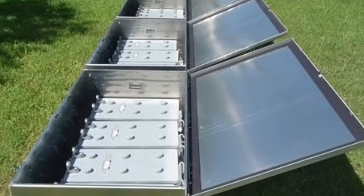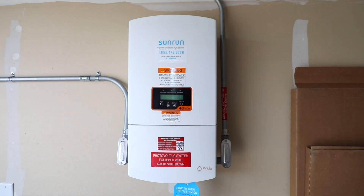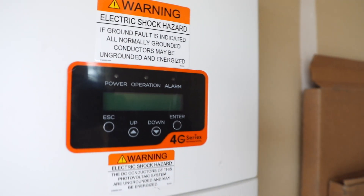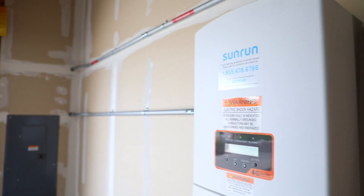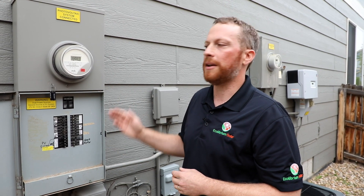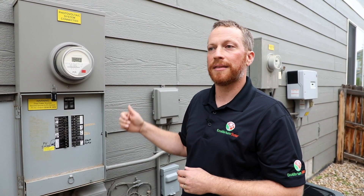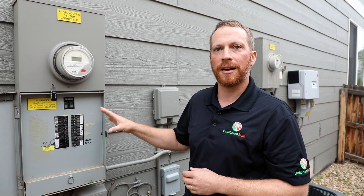You may find a battery bank — it could be a bank of batteries wired together contained in a battery box, or it could be a self-contained unit mounted to the wall that's a purpose-built battery bank. Often the charge controllers are integrated into the battery bank, or you may have a separate charge controller. But this is the basic equipment you're going to see on the ground: the inverter, some disconnects, maybe a production meter, maybe some monitoring equipment, and then an interconnection point.